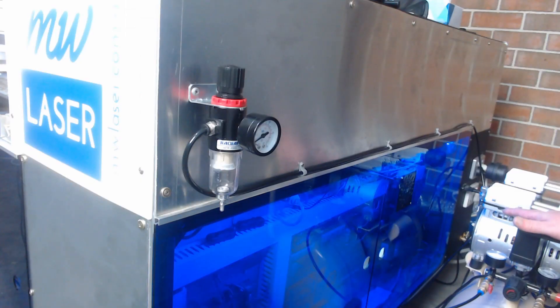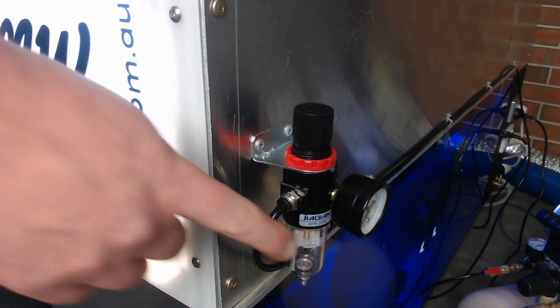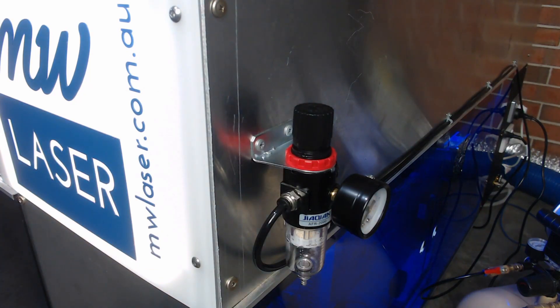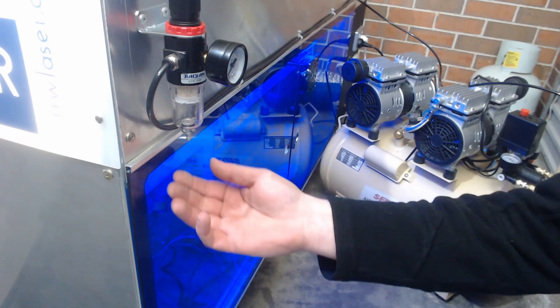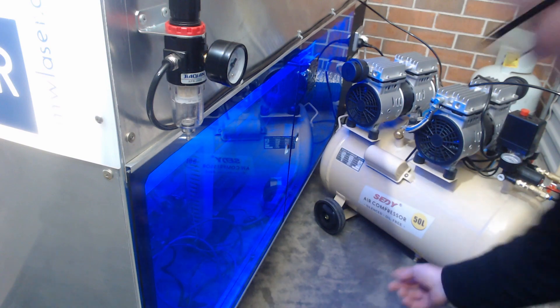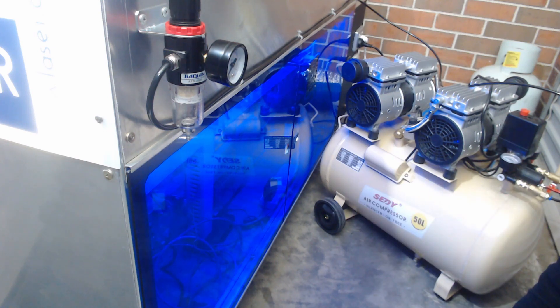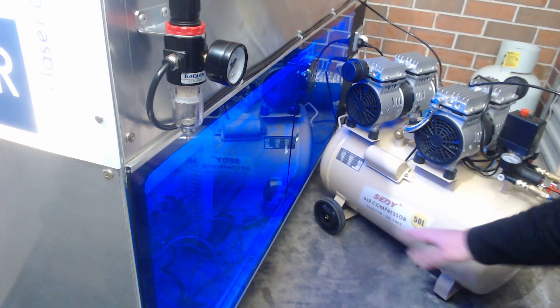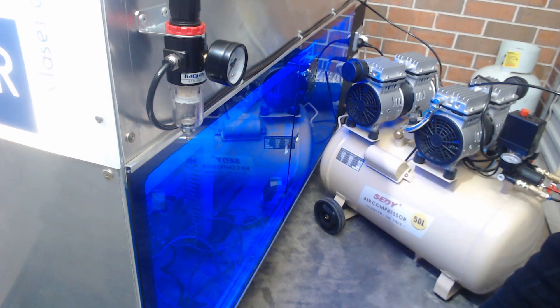I've got my air compressor here, plumbed in through this black hose. Next you'll need a flow regulator with a water trap. Water vapor is a byproduct of compressing air, and the amount of vapor produced depends on the environment, the humidity, and the temperature your compressor is operating in. It is recommended that you drain the water out of your trap regularly. You can pull it down and drain the water out, and put a little rubber hose on it so it flows away. Also on the bottom of the air compressor you have a drain valve — check your user manual for how to drain. Failure to drain water regularly could result in rust forming inside the tank, decreasing the lifespan of your equipment.